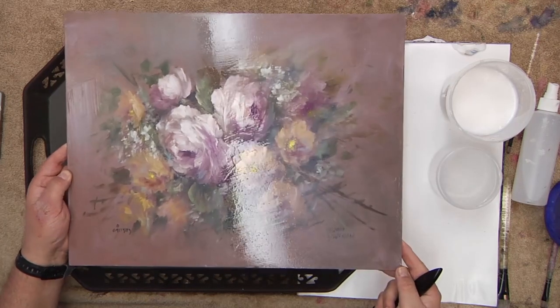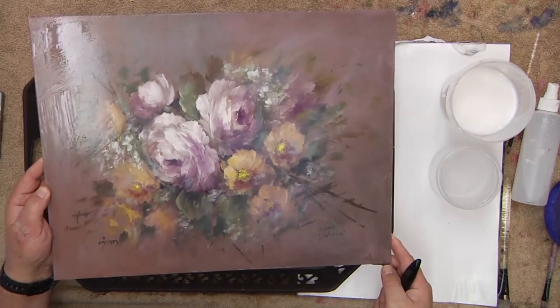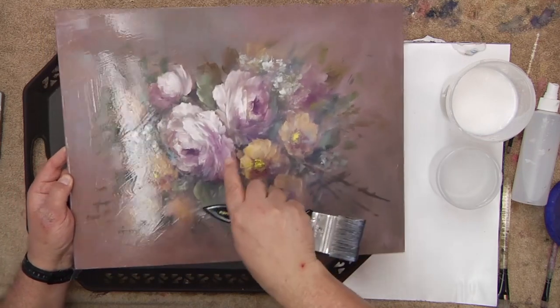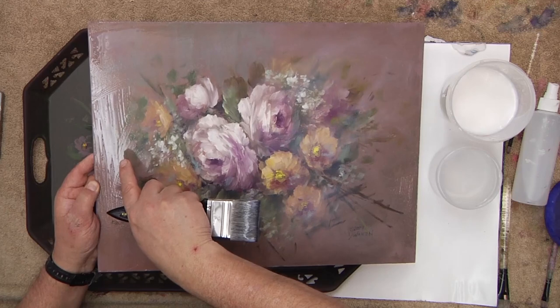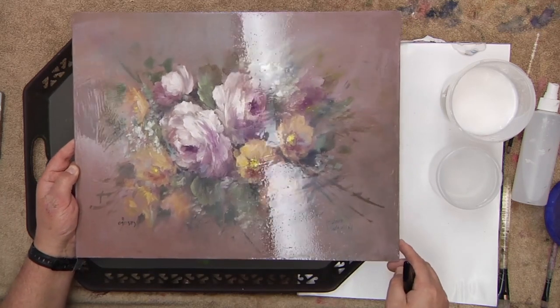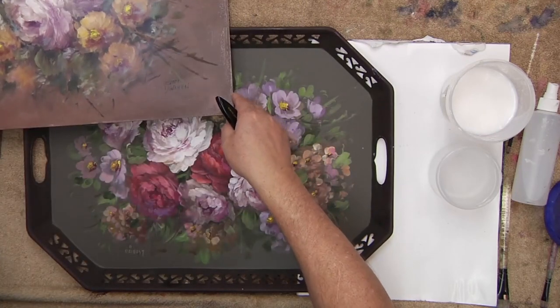And even with that lake effect, you'll see that the varnish, it's just laked onto the surface there, is starting to level out. You can see where it's starting even over here. You could just watch it start to level out and find its level. And that's because of the leveling agent. It's in there, and it's made to do that.